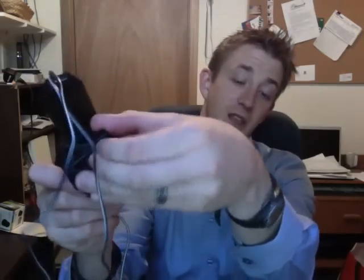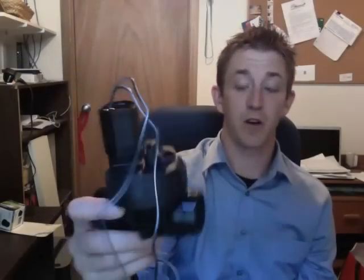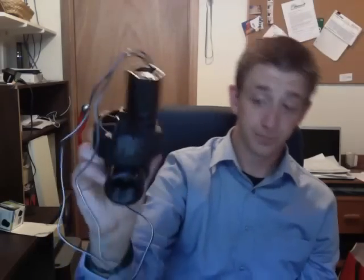So you can just take the bleed screw and just tighten that back up. Not like super tight, just finger tight, and you'll be good to go. And in a few seconds, it'll rebuild the pressure to actually turn off the valve again. Okay, so if you got 4 valves in your valve box, just repeat the process until you find the valve that's giving you an issue.